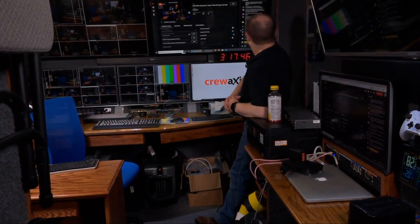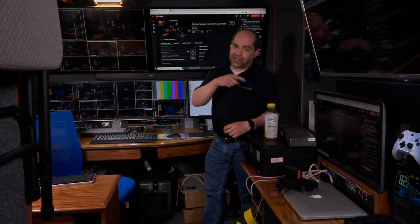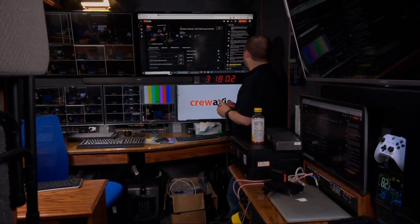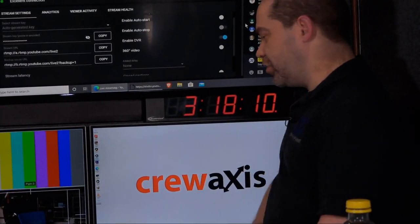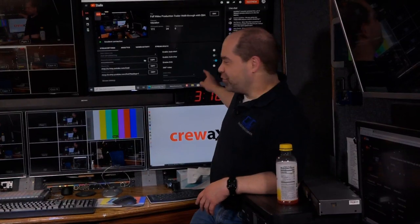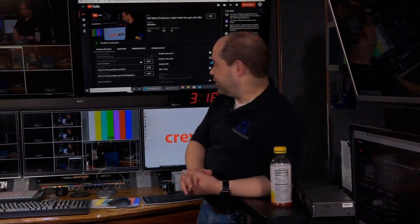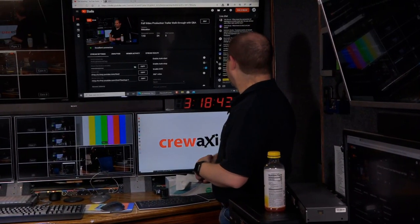For the fiber connection to the camera I did a video about that about a month ago, so just go back in my video feed to find that. The master clock here is from masterclock.com — I discovered them at NAB a few years ago. Most clocks like this are over $2,000, so I was excited to find one at only $500. It's powered over Ethernet and synchronizes time over the internet by pointing to an NTP server.